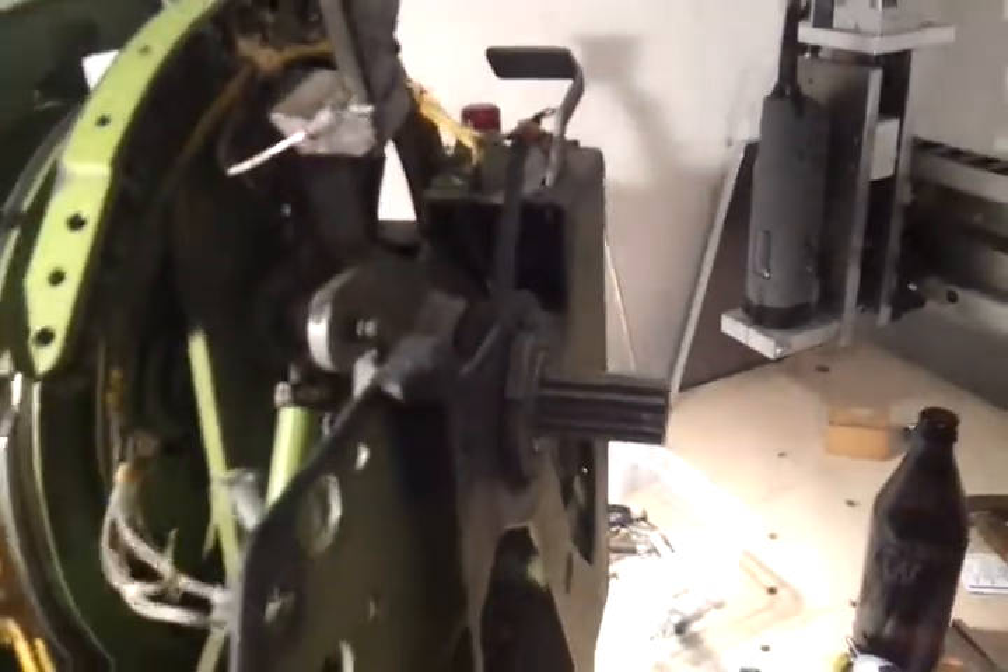What else is worth mentioning? This is the speed brake — it will be connected via this rod to a strong small servo motor. Some words about the trim indicator: this is this small dial here. It is moved by some lever mechanism that goes down to a small spindle, and the spindle comes out of this wire. And if I turn this, you can see the trim indicator is moving on both sides — so they are mechanically connected.